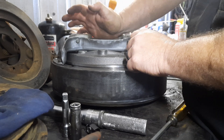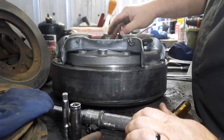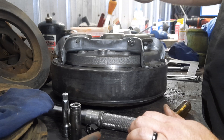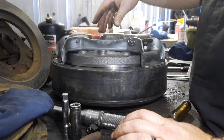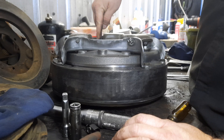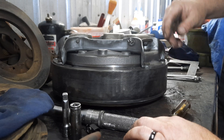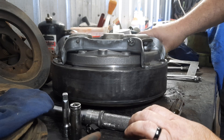John Deere says to actuate these a few times before you put it in, then recheck your measurements. These clutch fingers are really pretty difficult to push down, but it's not going to affect it that much. You can work them if you'd like — if not, it'll still be pretty close within measurement. That measurement, again, is 2.062 inches from this point on your clutch drum to this point on your clutch fingers. You don't have to have that special tool — you can outsmart it and come up with a solution yourself.